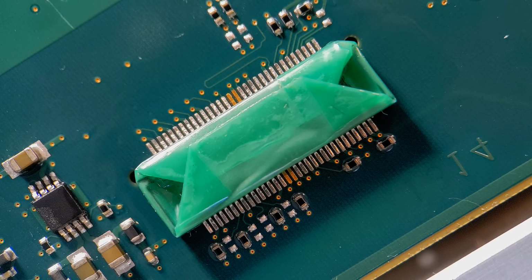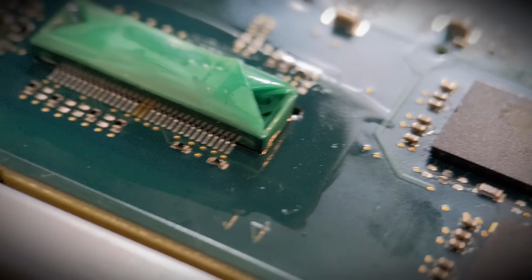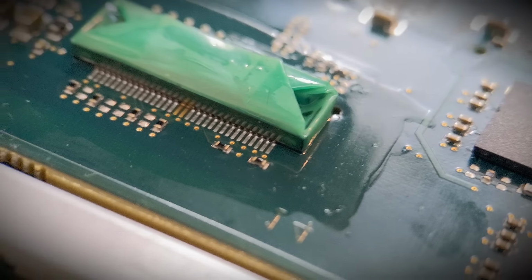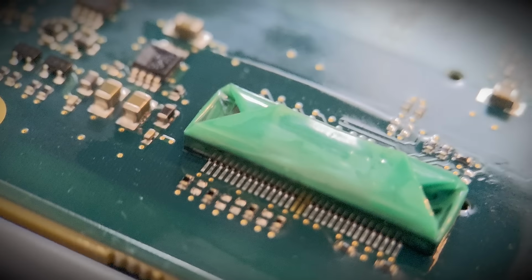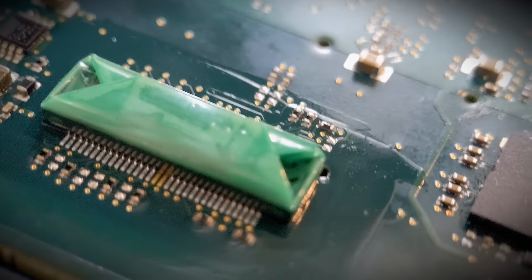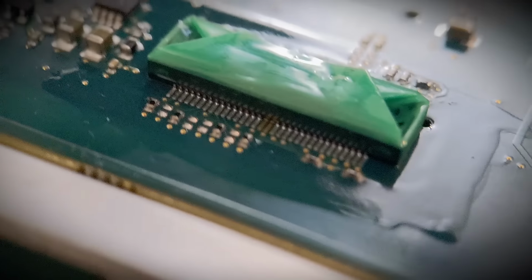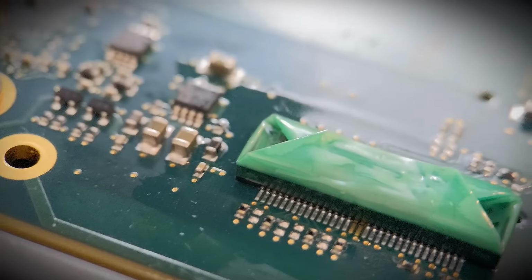I'll show a different angle when I take the tape off along the side, so hopefully you should see how easy this tape comes off, leaving a great finish. So I'll return when I'm ready to take the tape off, when the coating is cured. Just as I showed you with the other example, as you can see, you've got the coating. I've applied it around the connector, going down onto the board. I've just done this for the video, just to prove how good the tape is. But I've got quite an amount of coating around there. So it's going all around, as you can see. It's going to coat your pins, but you won't get any inside this connector using this 851 tape.